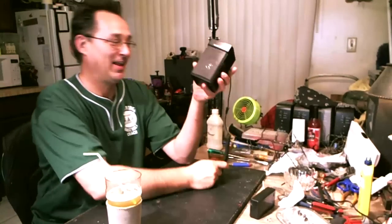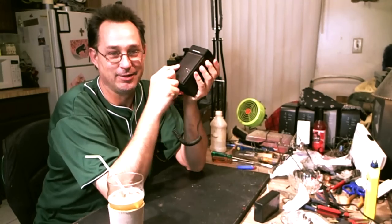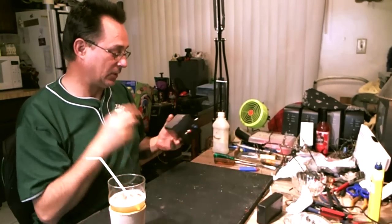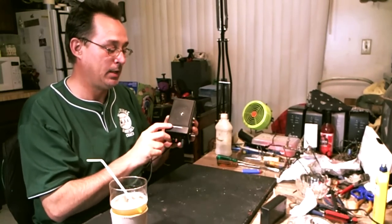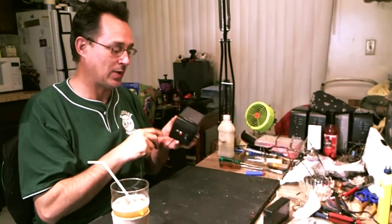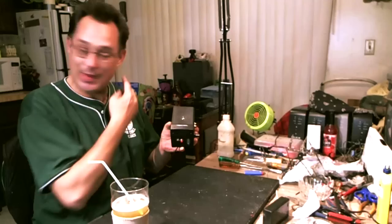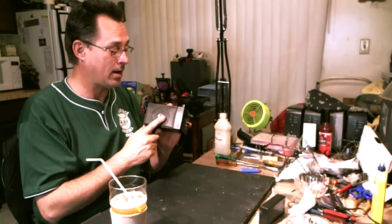I'm sure there's no practical application for the Barbie Glam Jet PA - I'll have to work this into some kind of musical problem. The circuit: there was a circuit point in here for the amp - the original Realistic speaker had an amp. Initially I didn't think the Glam Jet circuit would be that loud, so I connected that to the amp and it was really distorted. So I put a pot in between there to try to throttle it down a little bit. Then I thought, just for kicks, why not try going right into the onboard speaker - and sure enough, it was plenty loud.